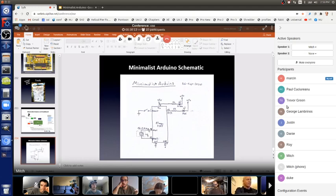But you've already seen a switch going between a pin and ground, but on the Arduino. But this has to be on the solderless breadboard now. So pin one of the chip goes through a wire to one side of the switch. The other side of the switch has a wire going to ground. The red lead of the power supply goes to pin 7. The black lead goes to pin 8 and 22. There's a wire going from the red of our power supply to this side of the green LED, and also to this side of this red LED. These are the plus sides. See the minus sign on the left of each part? So the minus side goes to a resistor in each of these, in this case to,